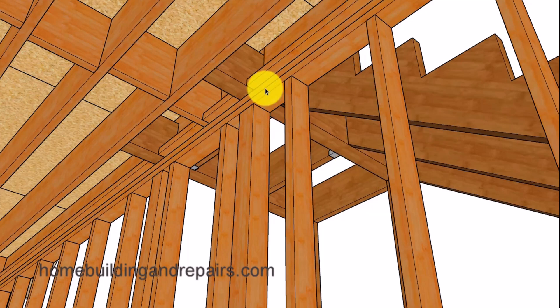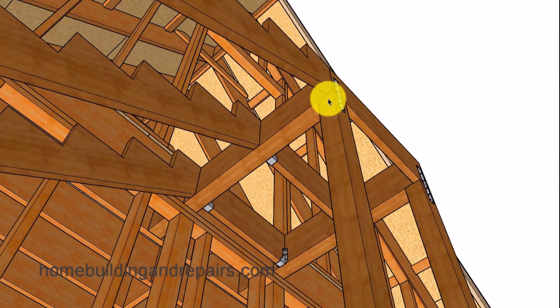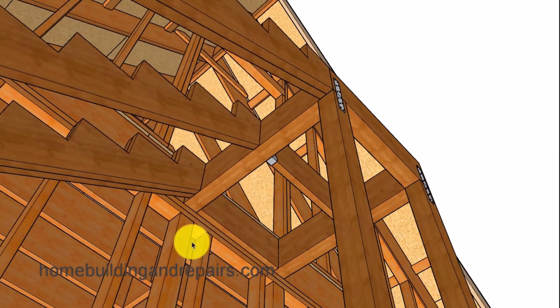Here you can see where the beams are sitting on top of the wall and butting into the first joist. Even though I would like to build something like this, I'm not going to buy an extra-long board for it. You might need a support post located inside the wall framing and underneath the beam to transfer the structural load from above down into the wall framing.